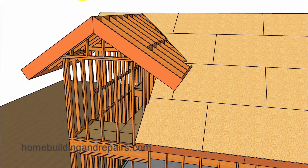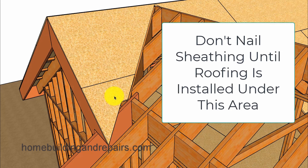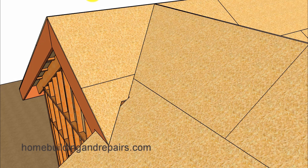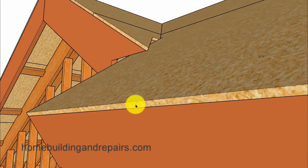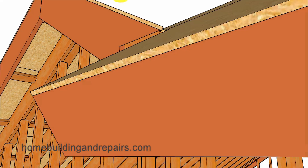I don't know if I have another video on that — if you need something on it, let me know. It's always a good idea to leave this piece off so the roofer can finish this section without it being in the way. That might be something your roofer will need to go over with you. Even though I left a larger gap here, you might not need to do that as long as this piece is removable. See how the fascia board is cut a little shorter for the gap there.